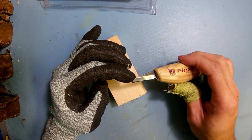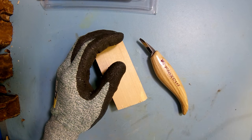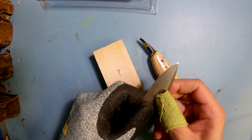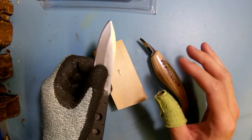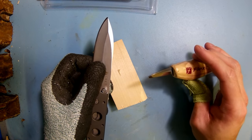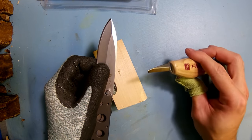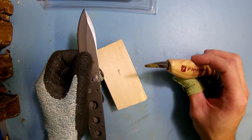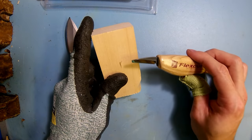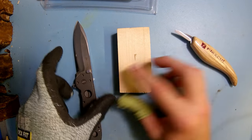It's because the knife is actually made of carbon steel. When compared to a common pocket knife, those knives are usually made of stainless steel which has a little bit more flex and is more forgiving when you're kind of abusing them. But carbon steel blades end up being more brittle — they have a much higher steel hardness which allows them to retain a sharper edge for longer, but in turn makes the whole thing more brittle. So as you saw there, it easily snapped when I plunged the blade in and tried to pry with it.